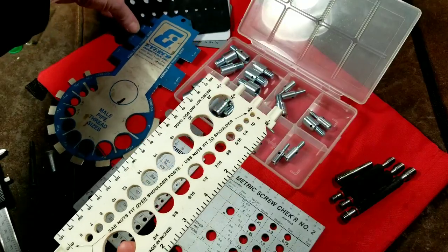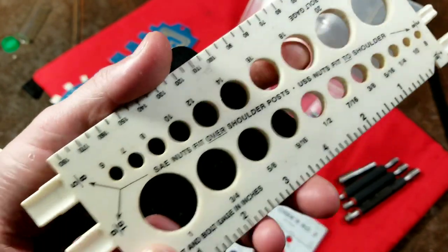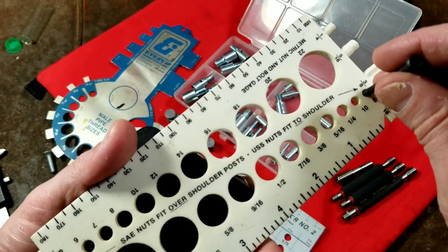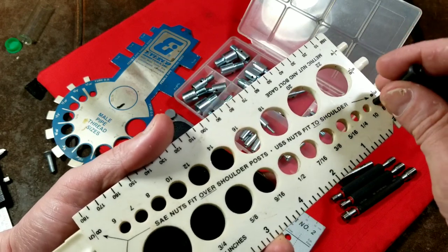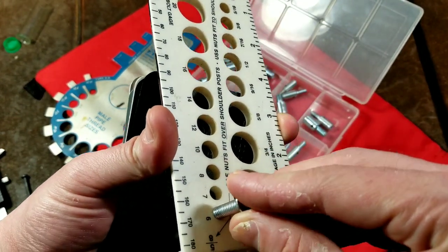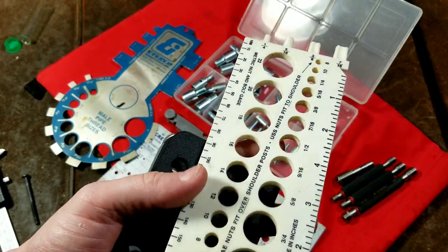Many of the common ones would be such as these — this is a real common fastener gauge. It's a nut and bolt gauge and it has posts for both metric and imperial. So if you have a metric fastener, this is a 4mm, so it's still just a bit too big. But if we have a quarter inch fastener, we put it in a quarter inch hole and we know it fits pretty good. We know it's not 6mm because it just doesn't quite fit. And then you just have a quick gauge to measure its length.